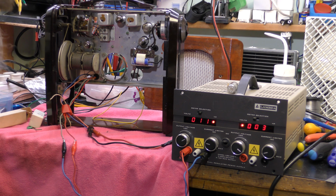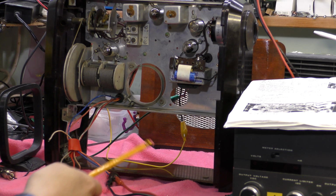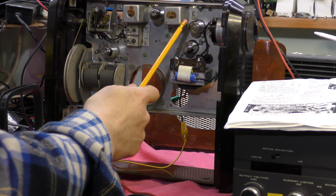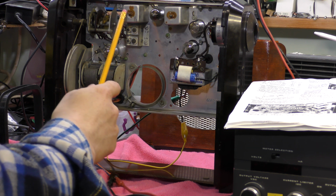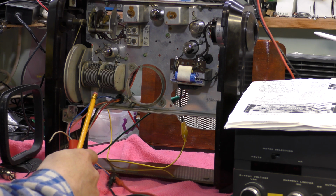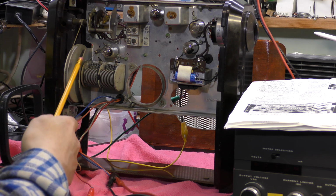Very good. Yes, that's looking very promising. I'm just preparing to set up the radio. There's the IFs to adjust, and you go from the detector backwards with this one. Also, you feed in the signal via the capacitor, which is interesting, which is of course connected to the grid.